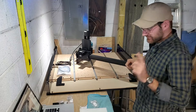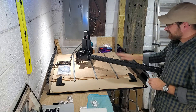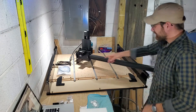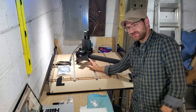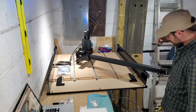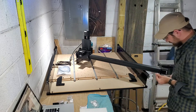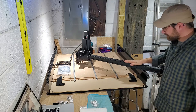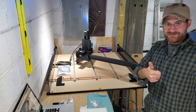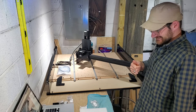Almost made another blunder. On the back side of the spindle gantry there also needs to be a t-nut, because your homing switch is here and it needs to actually touch something. There's a little stud we'll be adding that sits right here. So I need to pull off the side again, put in a t-nut, and hopefully no more disassembly required.